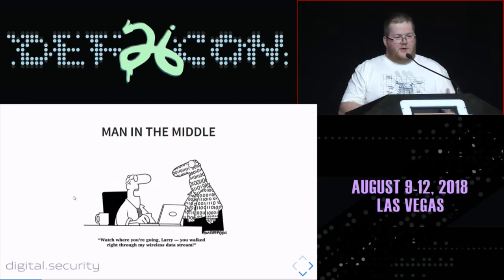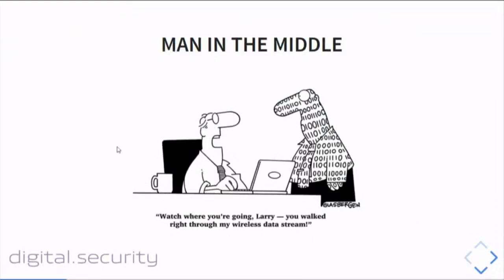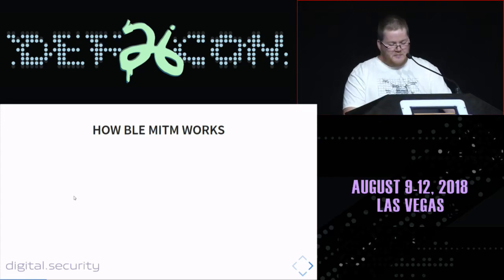Two cases here: you may have a lot of money and afford a lot of devices to sniff all 40 channels at once, or if you want to do it the cheaper way, you've got to struggle with BLE sniffing. You won't be able to sniff very easily for the first time — you've got to wait multiple connections to get your data. Two years ago, I took another approach for capturing BLE packets: a man-in-the-middle approach.